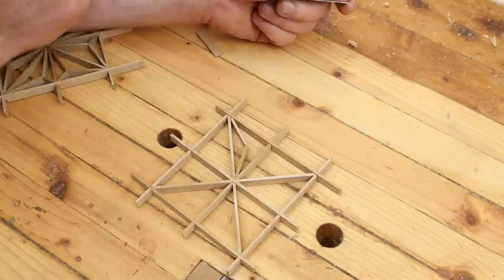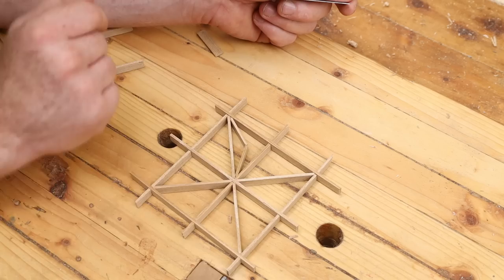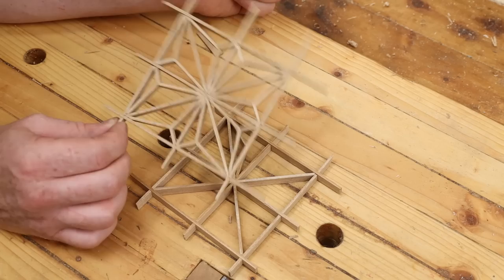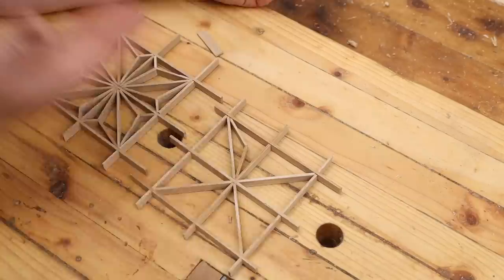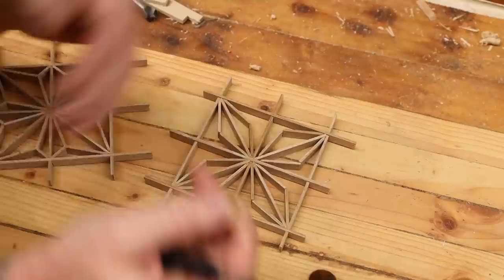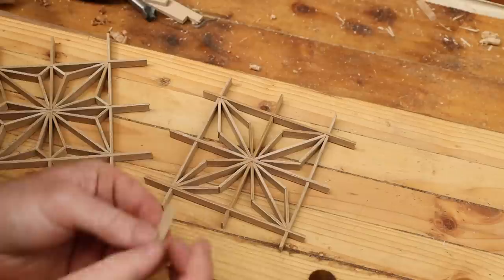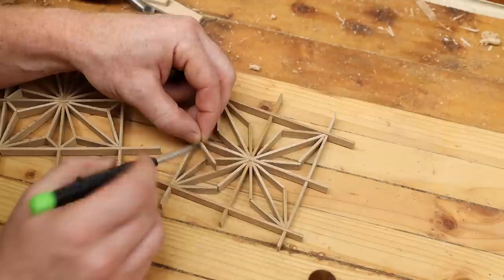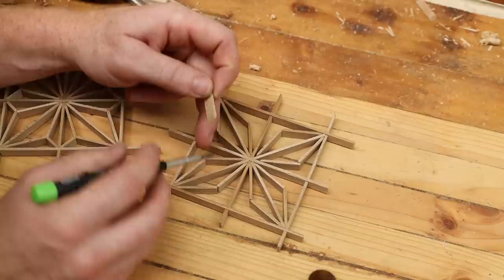I can now go and batch out the rest of the 16 pieces. The smaller key pieces are the easiest — they just have two cuts of 45 on each side, and they hold everything together. We have two per square, so eight in total. I put a 45 on both sides, keeping the angle nice and even, measure the length with a pencil mark, and cut them oversize. We want these to be a snug fit — not overly tight — but they should lock everything together. If a piece is too tight, pare a little off each side of the angle to reduce the overall length by a fraction.